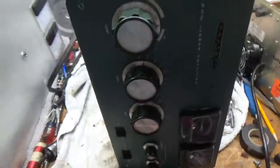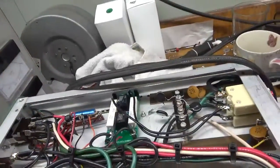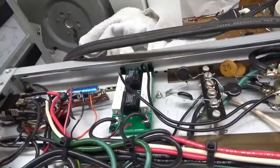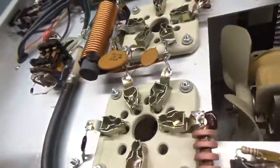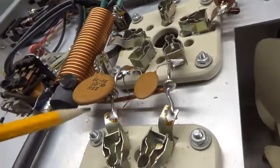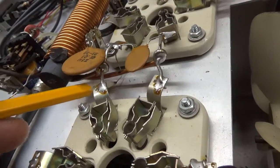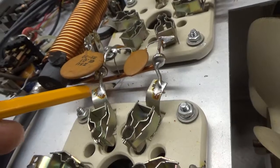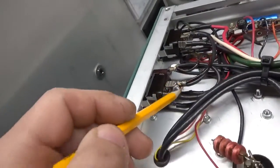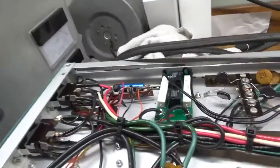Stay tuned, I'll be back. To clarify: if someone has a short upon startup before the relays engage, that's when those resistors fail. I also noticed something to point out — look at this lead for this ceramic disc cap, it's literally almost touching ground. Someone made a mistake there when they installed that. Someone also soldered a wire here for some reason at some point, so all of this stuff will get cleaned up.